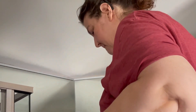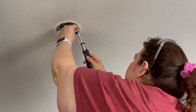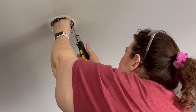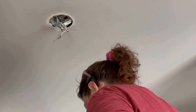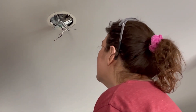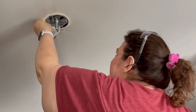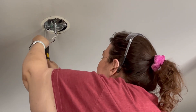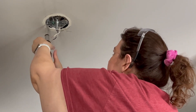These new brackets have fixed holes and sliding holes. I'm not sure the fixed holes will line up, so I'm going to use the sliding holes. I'll get the first screw started, then get the second one started before tightening either fully, because that is what's going to be holding our light and we don't want it loosey-goosey.